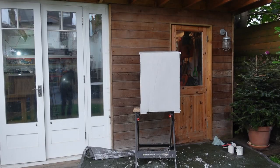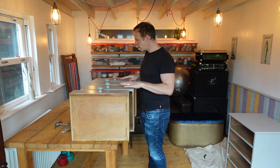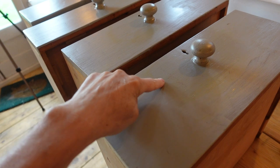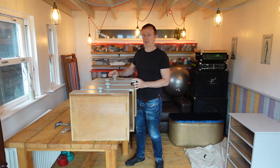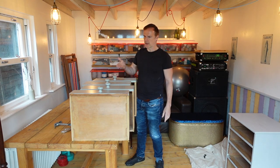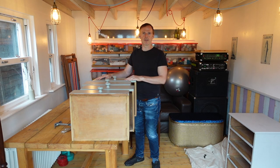There are still a few little marks and scratches and gaps in it. These have been drying overnight. They don't look too bad, but there's a couple of little funny bits on them — where the belt sander was a little bit too harsh, it's got a bit of a gouge in it, but I think I'll be able to just hand sand it out. Also, you can just see the varnish underneath where I didn't sand it properly has started to come through a bit as well — it's a bit darker. So I'm going to resolve that and give it another sand.